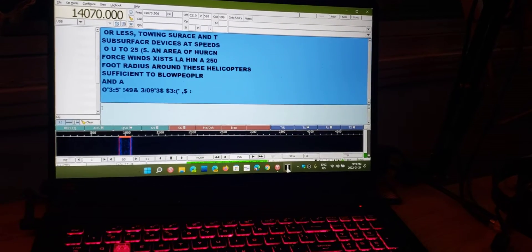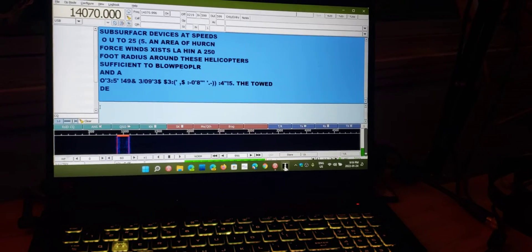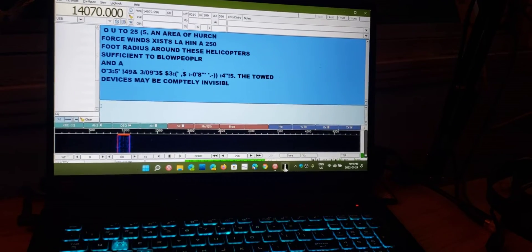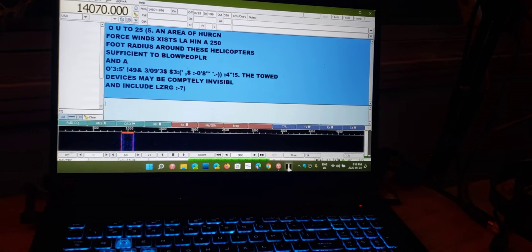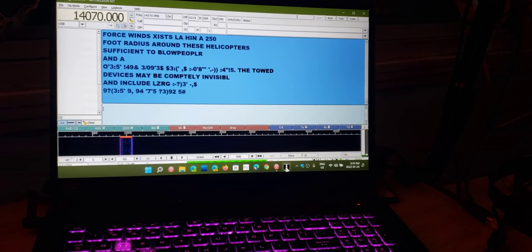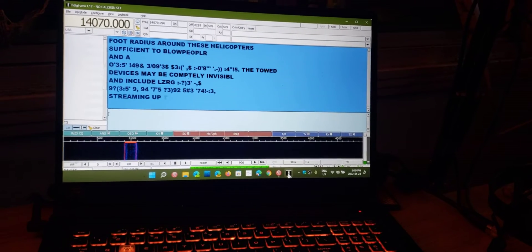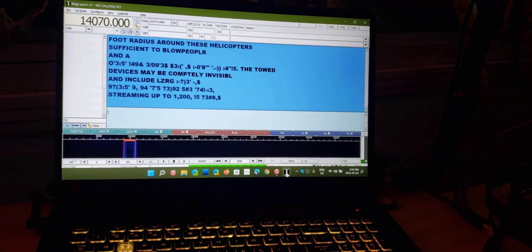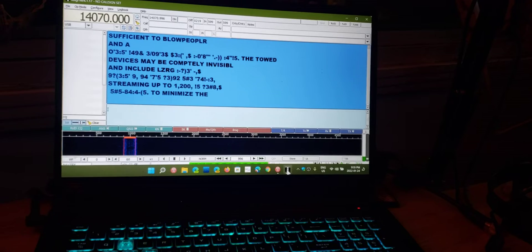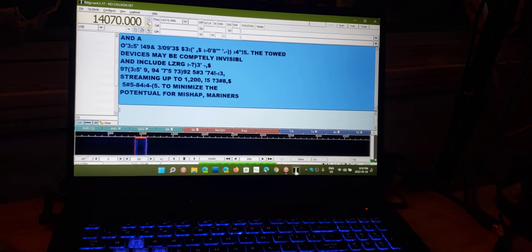One of the things I did was actually activate the high dynamic range mode for low frequencies. Maybe that's where it gets interesting, because we hear a lot of people preaching that the AirSpy HF Plus is superior to the SDRPlay RSP devices. On shortwave, I haven't seen any difference — I do not believe there's much difference, or enough to really matter. But where I have read a lot about the AirSpy HF Plus performance was on medium wave and long wave.